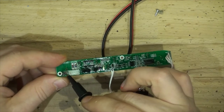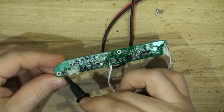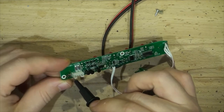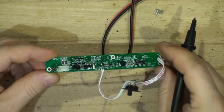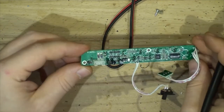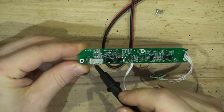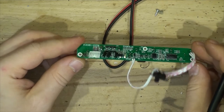And we've got our problem right here. This is the A1SHB — a P-channel MOSFET. And that's blown — really, really blown. You can see it's bulging. So that would be the problem. And that would be driving the motor because I can see the track going straight to the connectors, which is power in and the motor out.